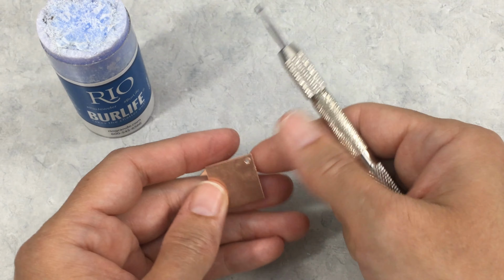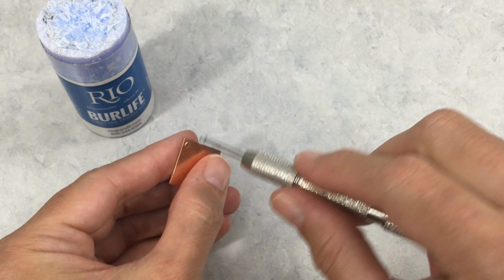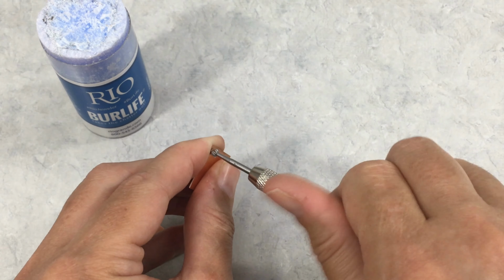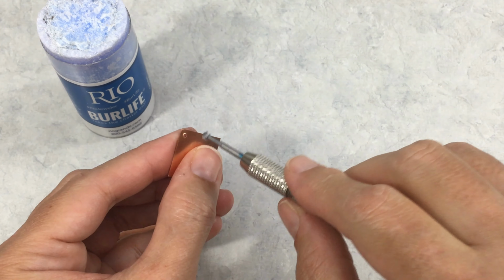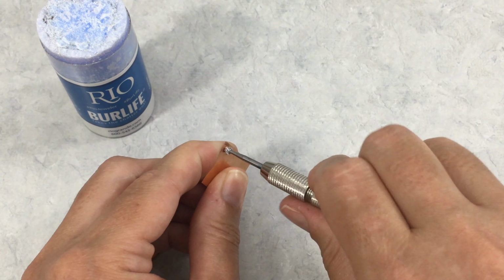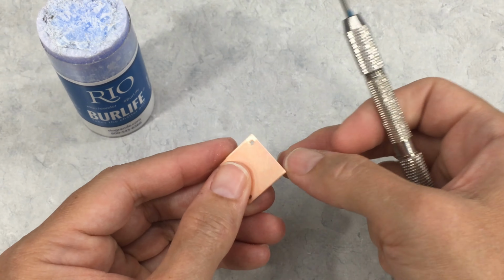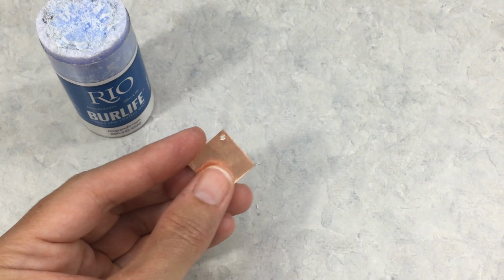And so once you go ahead and clean up all of the holes, that will make it easier to then clean the whole piece. But since you need the holes to connect your pieces, I find that I like to start with that first. Then for whatever reason, if your hole maybe went a little bit off course from where you wanted it to be, you can then file to adjust, make it a little bit more appealing to the eye.